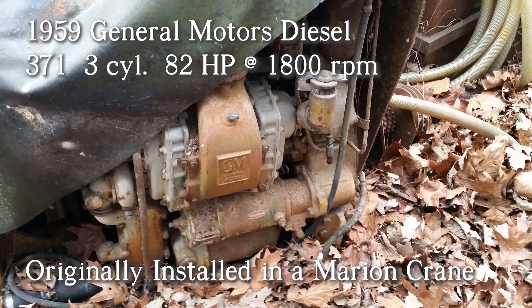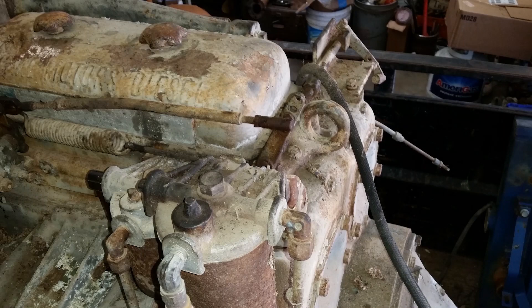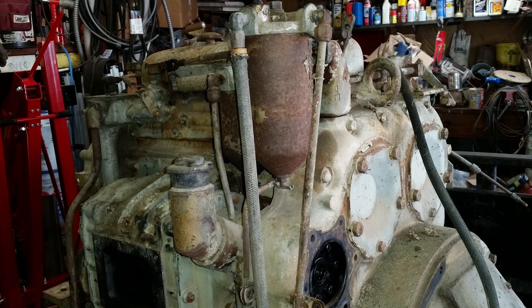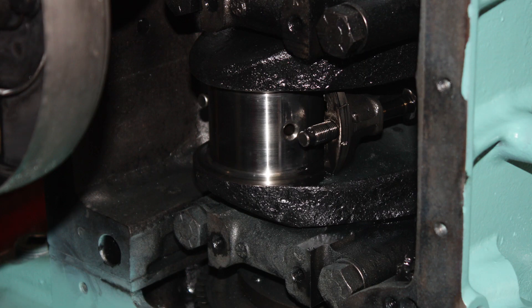I bought it out of the woods — it had been sitting for over 20 years. I dragged it home and started in on it. It turned out the intake and exhaust were filled with nuts; critters considered it a long-term storage unit. There was carbon buildup at the exhaust port indicating a leaking valve, so off with the head for some machine shop work.